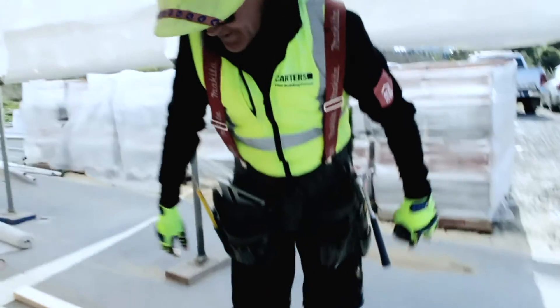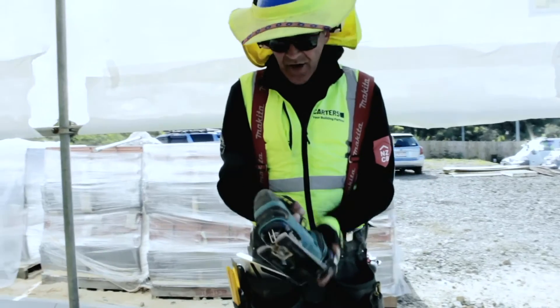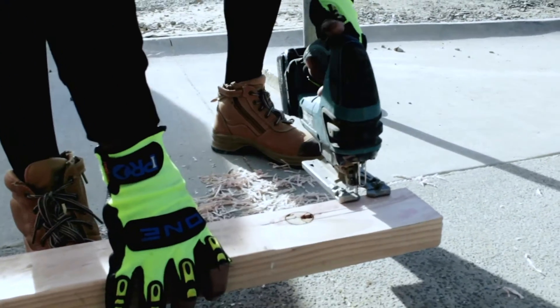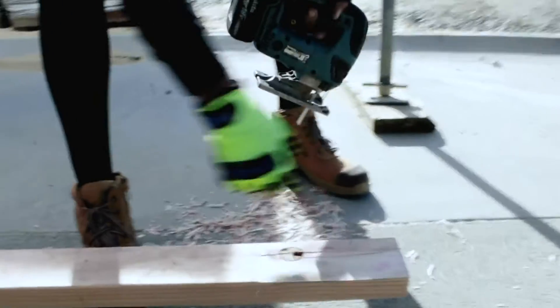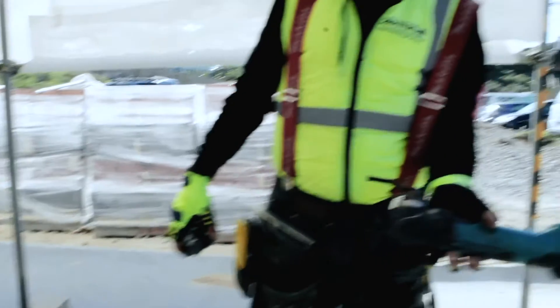Good tool, does the job. And then we'll go to another tool — the jigsaw. It's a nice little tool for cutting little round holes, because obviously the skilly can't do it. Pretty simple, aim up to the end, keep the blade away from the bit of timber, hit the trigger and off you go. It just cuts a nice corner cut for you.